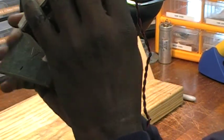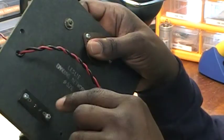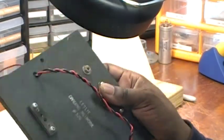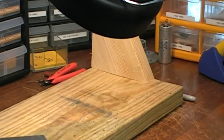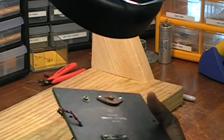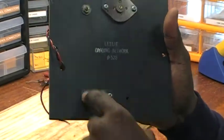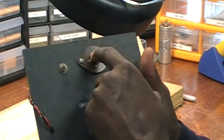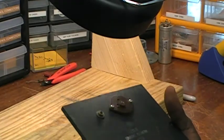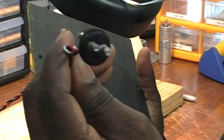The white wire goes all the way around over here to the treble side and is then soldered into this socket, and connected to this side of these bass capacitors. The other side of these bass capacitors is wound together and connected to this black wire, which goes to this other side of the socket. That makes up the cord that inputs here in order to operate your speakers — you have your bass speaker here and your upper driver here — and then this cord, which is what I'm getting ready to connect, goes into the amplifier.